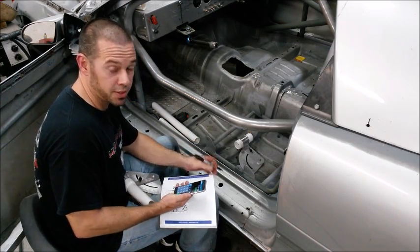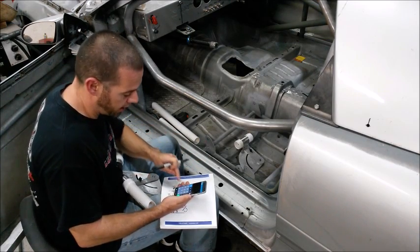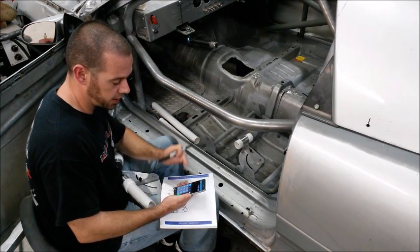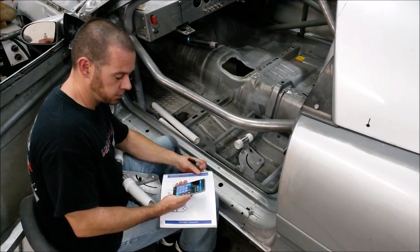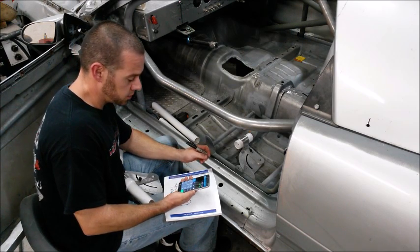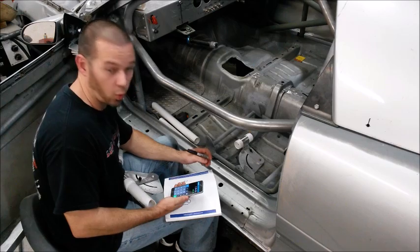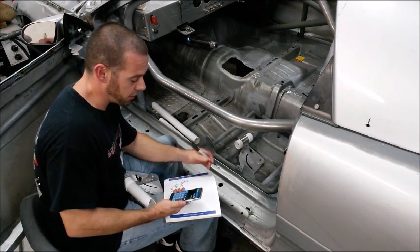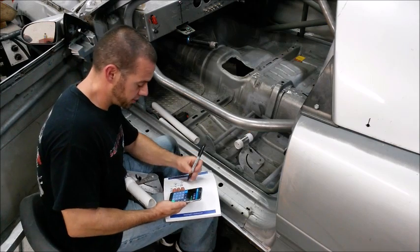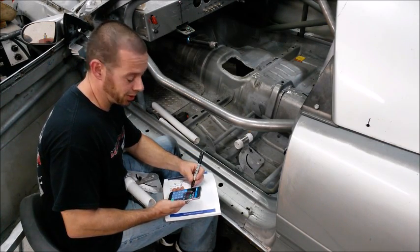So over here we had 36 degrees, so same thing again, 1.15 times 3.6, and that gives me 4.14. So that's close enough. Again, I'll round up to 4 3/16. I'd rather have a little bit too much material than not enough, because once it's too short, it doesn't get any longer.